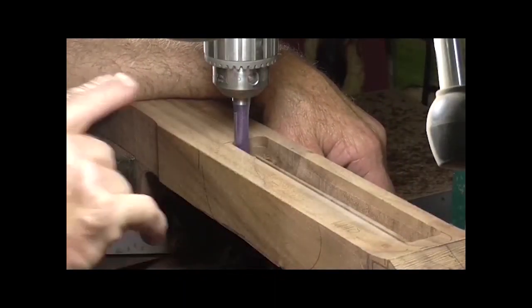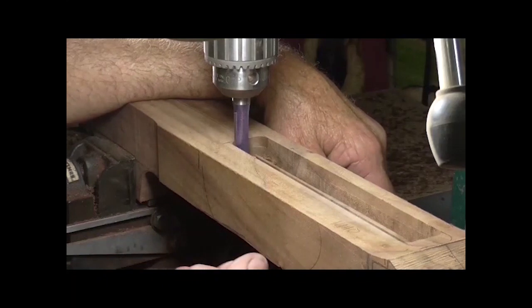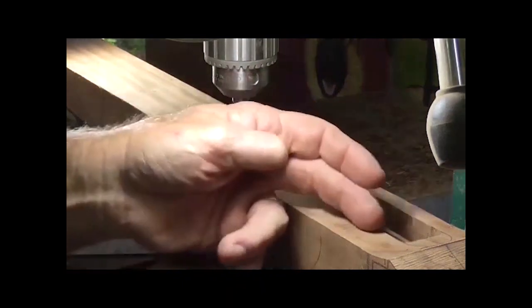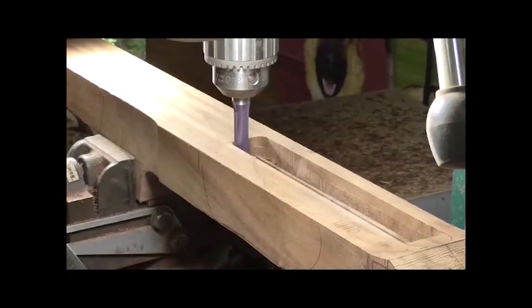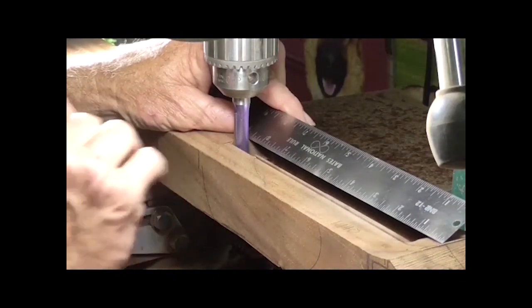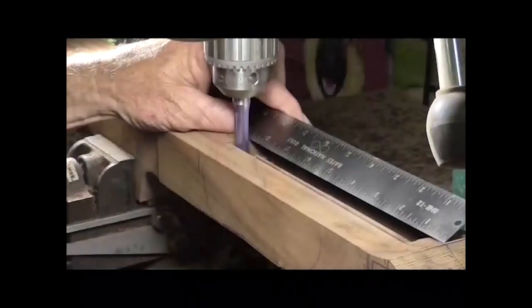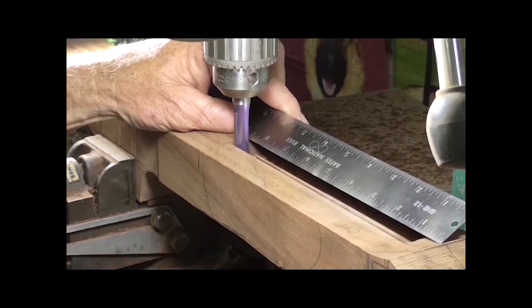I'm going to cut it out like it is, and then I'm going to mark some new lines and make my taper. But I'm going to punch this all the way out down to the bottom and cut a slot completely out of it, because that trigger guard and the trigger assembly slips up in there, and it's the same width as the receiver underneath it. The furthest forward I can go with this cut and punch all the way out is 8 1/8 from the back of this semicircle to there, because that's where that little angled receiver is. I can't go past right there, going all the way out the bottom. I'm glad I checked that right now. That would have been hard to fix later.